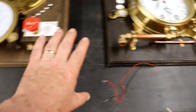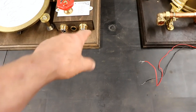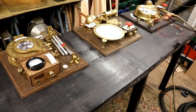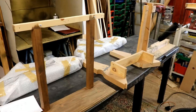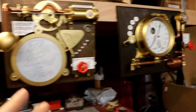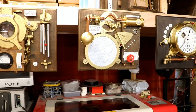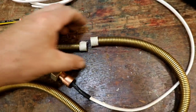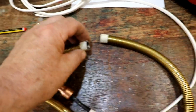Today's job is to work out the length of tube to go from there to there, and from there to the USB adapter. I've arranged these to the correct spacing as required by the customer. A bit of lateral thinking is necessary because I want the tubes to hang vertically — six screws in the front of the hanging shelf, all nicely arranged. I've got both pipes lined up and can get them out of one length. I wrapped masking tape around it, put it in a vice, and used a junior hacksaw — cuts really cleanly and doesn't spring and unfurl.